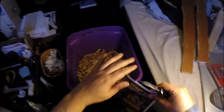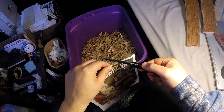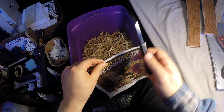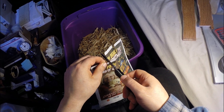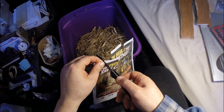So this is a relatively coarse edge — 320 grit, 46 micron. It should be able to do a 45-degree push cut on a horizontal and a 45-degree push cut on a vertical extremely easily, and it should be able to do a true 90-degree push cut really close to the point of hold. There you go. So that's decent enough to start with.